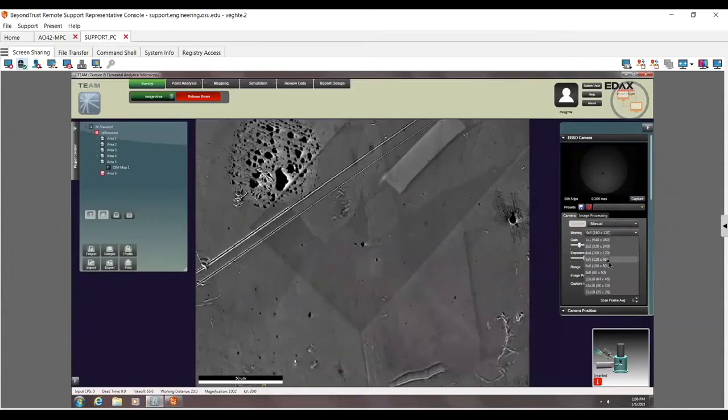If I change this, let's say 8x8, we're going to see this go up by a lot, because now instead of 16 pixels, I'm doing 64 pixels. So now at 8x8 binning, go ahead and click on this, you're going to see the signal is way up. Now this is actually saturated, so I went basically up by a factor of 4. And also, you can see the pattern quality doesn't get that much worse, because you don't really lose that much definition. But again, it does get worse when you do that.